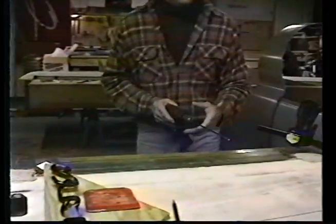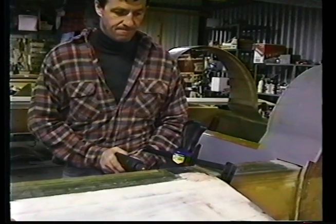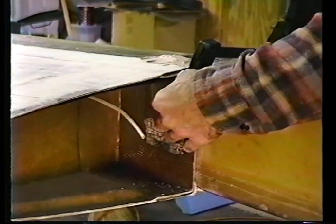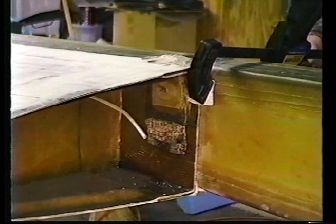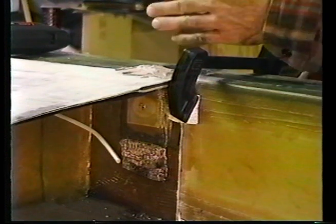And remember when we did this hole here on this side? By going from this surface and riding in this hole on the opposing side, it automatically maintains perpendicularity as I go to the opposing side. And I've got a lot of meat to go through on this side because I've got 1/8, 1/4, 1/8. Of course, I would prefer not to break the glass free around the plate, but really the bond of this one-ply glass is doing nothing but holding it in its position. When we bolt this up and clamp it, it really doesn't matter one bit if the glass is attached or not. Even the other plies of material, the laminates, if they delaminate, or the fact that the bushing is shorter than all the laminates, including the aluminum, it forces everything to be squeezed together so that a bond failure really is of no consequence whatsoever.